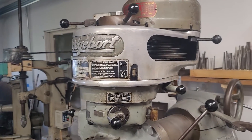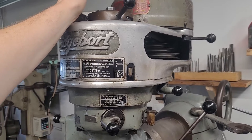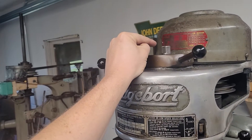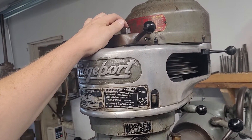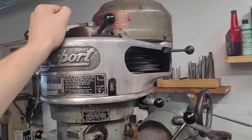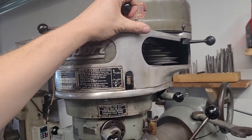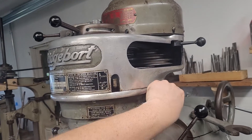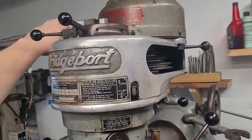That is spindle reverse, so we're going to run the motor in reverse to turn the motor clockwise. Now this spindle is turning at 80 RPM — you can actually see how slowly we're spinning. This now has about 65 foot-pounds of torque. This will absolutely break fingers if you do something stupid. Don't do something stupid with these machines, they can hurt you very badly. To go back into high range, you turn the selector forward, disengage that lever, and now we're running in high range at 660 RPM.